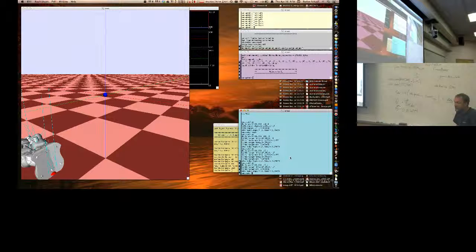So the hope is that you get this going on the simulator first. And after you've got it going on the simulator, we'll try to get it on the real robots and see how well that works. Now, you will notice there is a big difference between the simulator and the real robots. These simulators are perfect physical systems. That means we are simulating rigid body dynamics, and it behaves like a proper rigid body dynamic system with a certain amount of friction, certain inertial properties, no weird things. The real robot has a huge amount of extra friction from gears and gearboxes and all kinds of things, so it will actually behave quite differently.